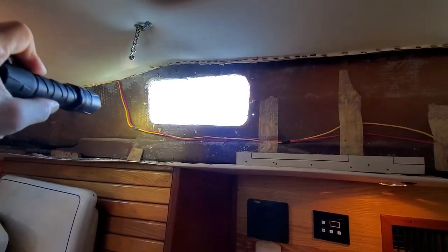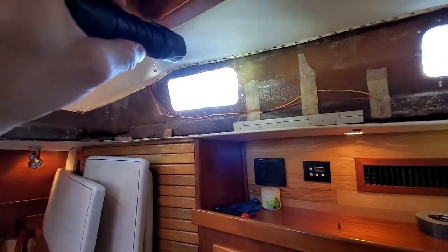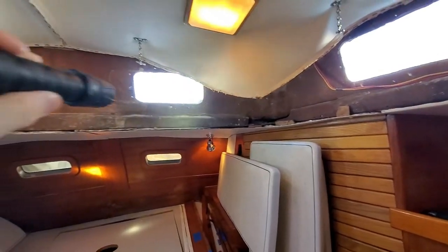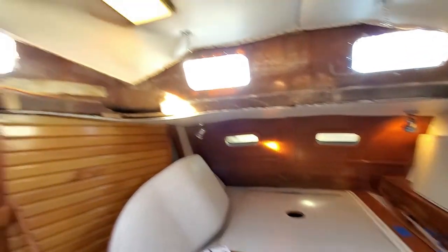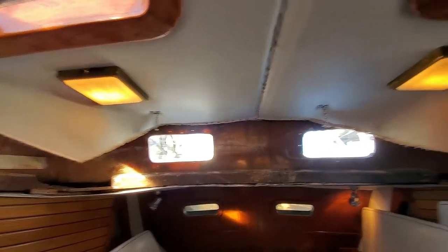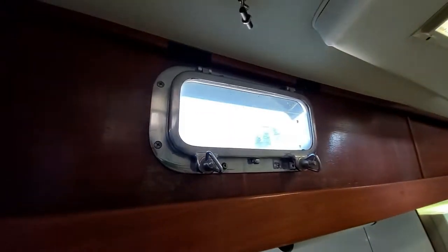What we're going to do is fill all those up. Then I'll draw an outline of where the port light's supposed to go, drill new holes, and fill them with thickened epoxy. After building up the fiberglass around here, I'm just going to put one real thick layer of heavy cloth fiberglass. That way it's going to give the mounting fasteners a little bit of structure to hold on to. Right now they were just barely holding those port lights in — I think the only thing really holding them in was the 5200 seal. The screws just pulled right out.